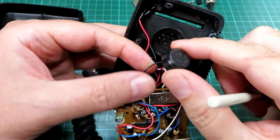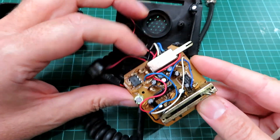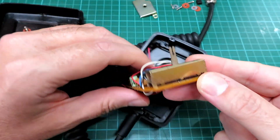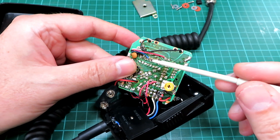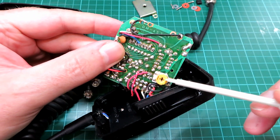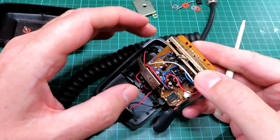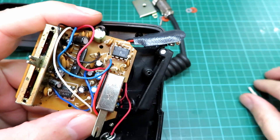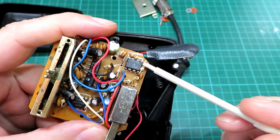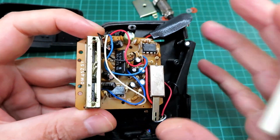What have we got on the inside? Well, we have a small condenser microphone and obviously that's going to be coupled into one of these ICs on the board. There's our PTT button. There's our slider for the volume control of the effect. The echo effect is generated inside by the chip — this potentiometer here adjusts the level of the echo, and then you have a variable control over the power on the front of the device. In the top right hand corner, here's the bit that provides that lovely echo — this is the Sony CX7932, which is an echo delay chip, quite an old device now, long obsolete. So if you have one of these and that chip goes, I think you've probably had it.